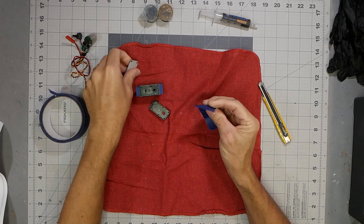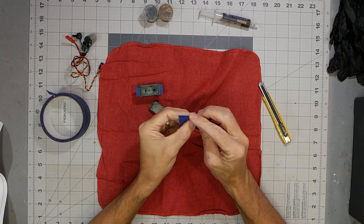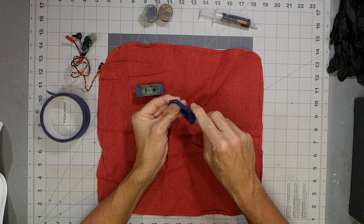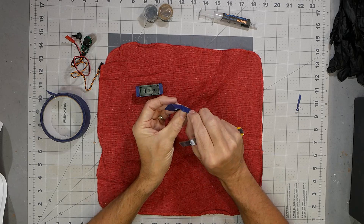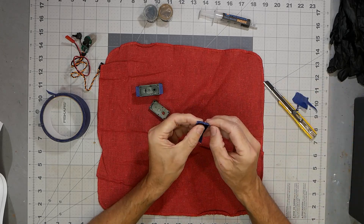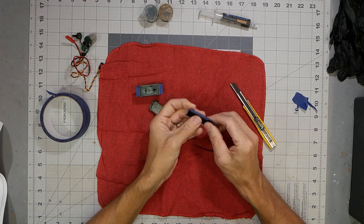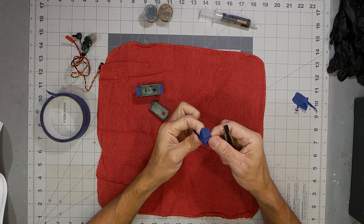Here I'm applying tape to the servo case. The reason is that they want this thing to be waterproof, but they don't have a custom O-ring like a lot of servos would that goes in between each layer for dust and waterproofing. So the compromise is to put Permatex gasket sealant in between each layer. The tape is there to keep the Permatex from getting on the outside of the case and making cleanup more difficult later.